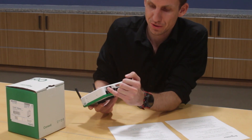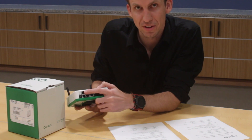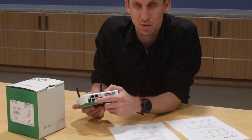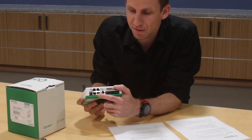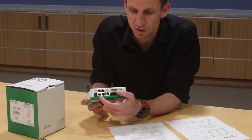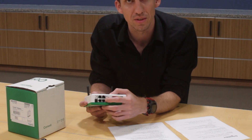It's very important to note how Xanbus 1 and Xanbus 2 are distinguished across these four connectors. Xanbus port 1 refers to the two connectors on the left-hand side, one above the other. For example, inverters on Xanbus 1 would be daisy chained together, with the last cable running to one of the two connectors on port 1 and a terminating resistor at the other end. Critically, you must not run the other end of that network across into the second Xanbus port — using both Xanbus ports for one network of devices is not supported. If you want more devices connected, they must form their own daisy chain network connecting to the second Xanbus port.